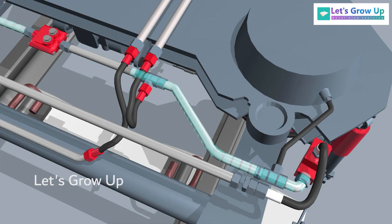The output air from the leveling valve enters the air springs (bellows) and then connects with the duplex check valve to monitor air pressure.